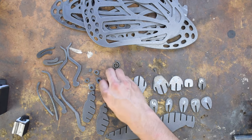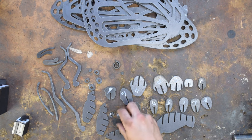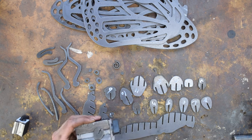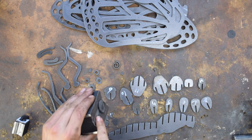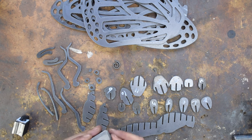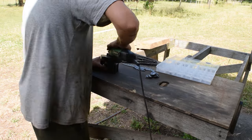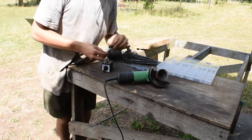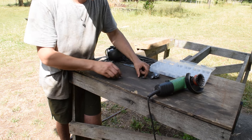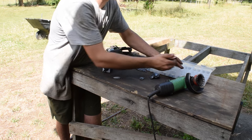Here are all the bits cut out. There's a bit of slag or dross on the bottom so I like to clean it up with a wire wheel. Some of these bits — like the first couple and the eyes — are too small to hold with clamps, so I use a switching magnet. Be careful: if you come at too much of an angle on smaller parts, they will leave the table at Mach 1 and you'll never see them again. Organization is key — as soon as you clean them up you lose your number and order, so keeping them in a box is fantastic.